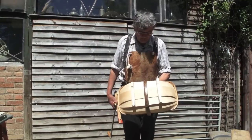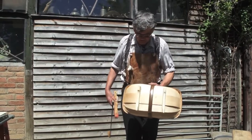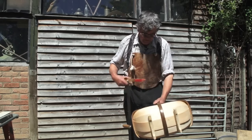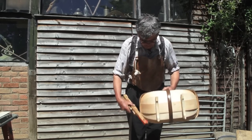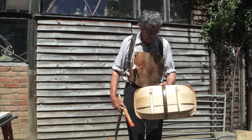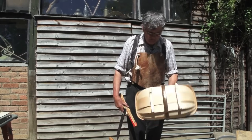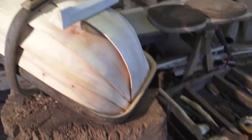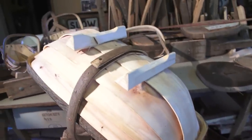While we're waiting for the steamer to soften the wood, we can make some stands — these are the stands or feet. As I said, if it's a very big trug you wouldn't have feet, you'd just have straps going across to strengthen it. You could use sawn material, but they never look quite the same as the handmade cleft one. So I'm going to show you the traditional way of making the stands out of a piece of willow.